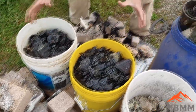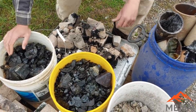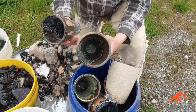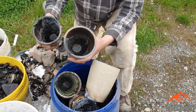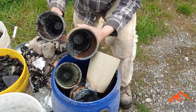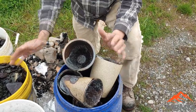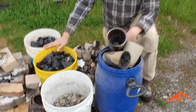So my plan is I'm going to run all the slag and the fire brick together, and then separately we're going to run all my used crucibles. These are crucibles that have leaked or broken or I've used up. They only have a certain shelf life. And I want to do them separate because my guess is that if we have lost any precious metals, they're going to be in these crucibles. And so I want to see that separate. But we'll run the slag first, and then we'll run the crucible second and see what we get.